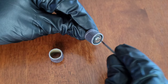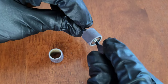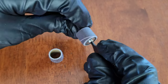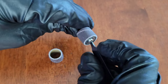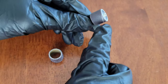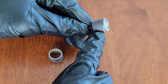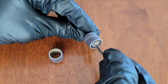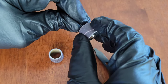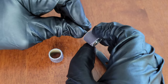You want to make sure that the sanding band stays on there properly while you're doing this. It might have a tendency to slide up or down, so just keep an eye on that. Keep tightening this down — you want to make sure you get it all the way tight. The sanding drum mandrel compresses down and holds the sanding band in place. Once you've gotten that secure, you can test it to make sure the sanding band is holding on there firmly.